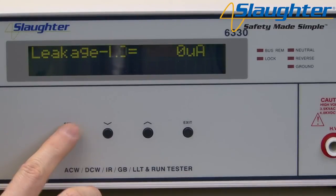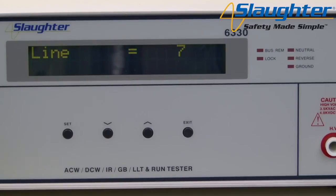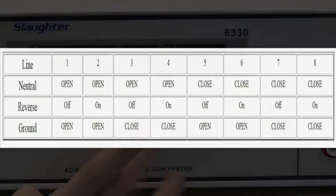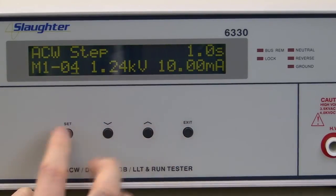Continue until you reach the line parameter. The line parameter indicates the status of the fault conditions for a line leakage test. Fault conditions include an open neutral conductor, polarity reversal, and an open ground conductor. Fault conditions are designed to simulate worst case scenarios for electrical hazards while the DUT is running. There are a total of eight different conditions that may be configured. Please refer to your appropriate safety standard to determine which conditions apply to testing on your product. When in doubt, it is recommended that all eight line conditions be run in a single test sequence to ensure all possible test cases are covered. Line condition seven — closed neutral, normal polarity, and closed ground — is referred to as normal condition. For this video demonstration, we will set up a sequence with four separate line conditions.